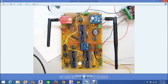This board requires 2 voltages. This connector and this connector down here are 3.3 volts in, and this connector is a 5 volts in for some of the 5-volt circuitry on the board. This is a temporary power supply that I built in the past. However, now I have another version of it that uses switching regulators, and it's very efficient and also has the intelligence to be able to shut the system down.